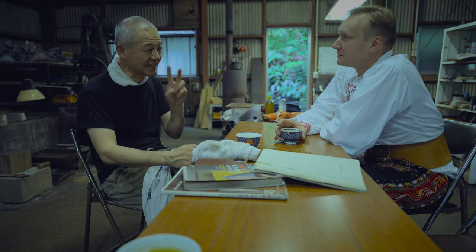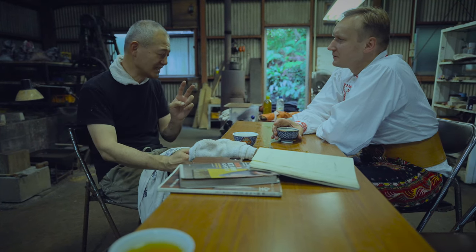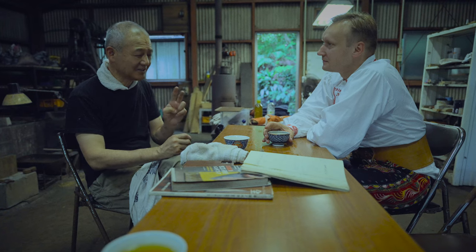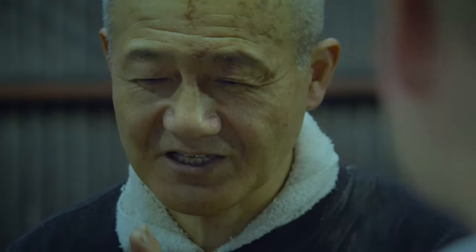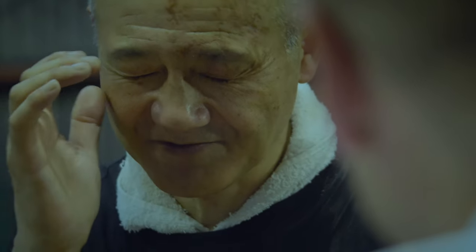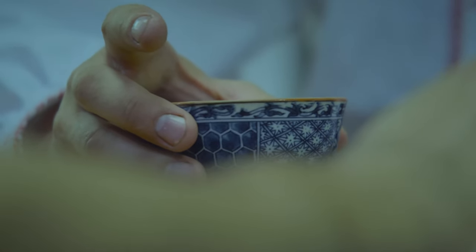Second day is exactly Tatara iron making. Maybe it's 8 o'clock start. Start fire, and after about 2 hours, only fire by fire. And after this, about 1 hour, only fire by charcoal. We take 3 hours to heat up the inside. These 3 hours we only use charcoal and fire, just to heat up the furnace before. So it's ready, temperature heating.